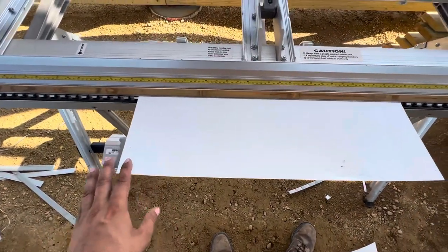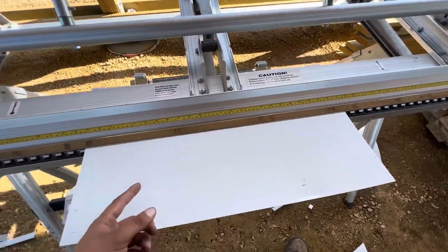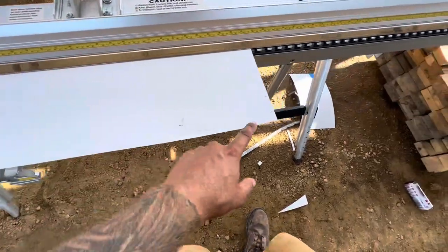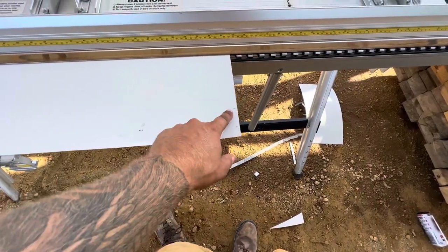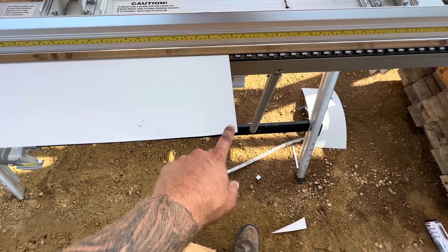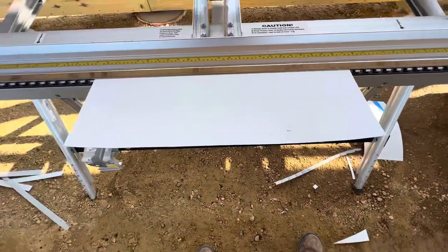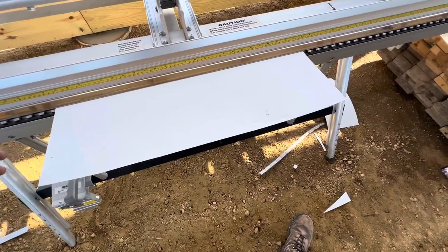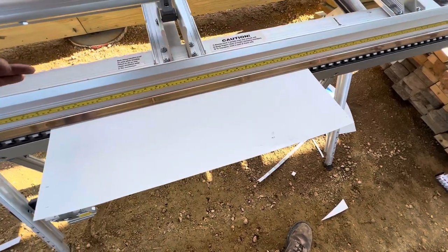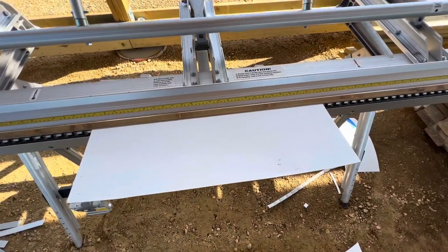On the brake we have our piece 14 inches this way and 25 inches this way. We're going to make our first mark at three-quarter and our second one at two-and-a-quarter — same on the other side, three-quarter and two-and-a-quarter. That gives us a three-quarter fold for our hem. We'll fold that one all the way over and fold this one to 90 degrees, giving us our L-shape. Then we'll cut an angle from 12 inches up here down to five inches over here.